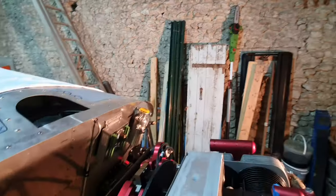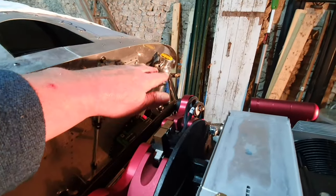And it uses a couple of ports on the turbocharger that are designed for cooling. And it pumps water with a little electric pump through a little additional radiator, which is normally mounted by the Sonex in this area here.